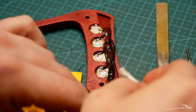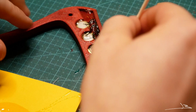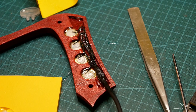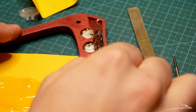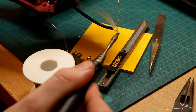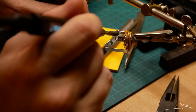The most stressful part was flooding the wire pocket with epoxy to hold everything in place. In theory this shouldn't cause problems, but because this epoxy reacts so quickly it also heats up quite violently, causing the whole thing to expand and try to push out of the pocket. After the epoxy hardened a bit and wasn't sticky anymore, I clamped something flat — in this case the lighter — to the whole thing so nothing could expand. I would highly advise against using any of these crazy fast-setting epoxies.